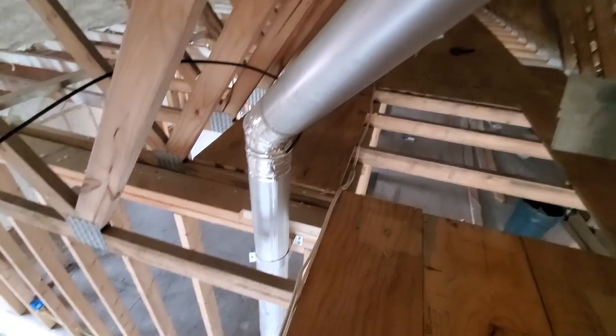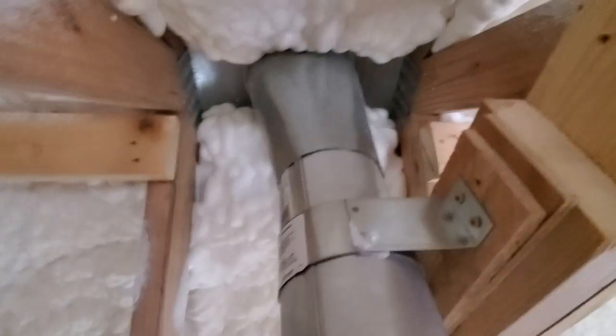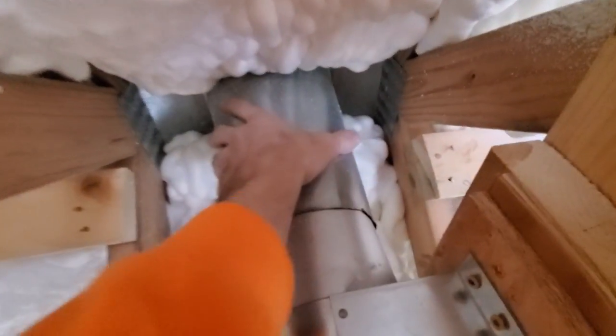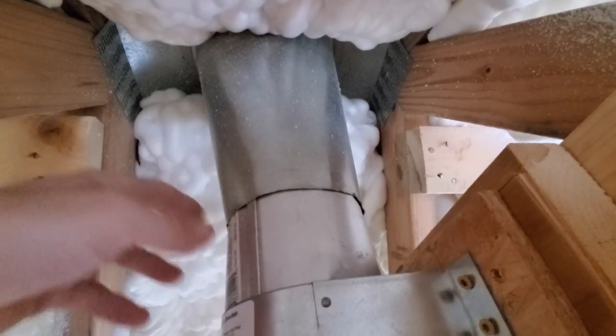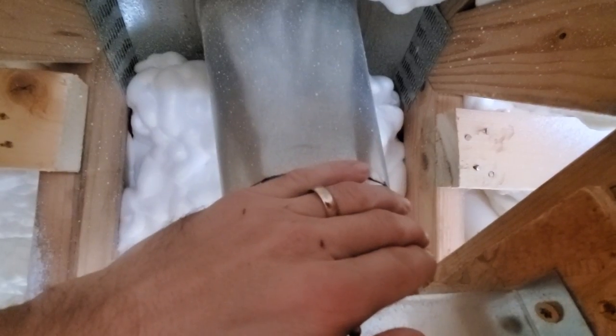This is forced air — the fan in the pellet stove is pushing air out, keeping the pipe from getting really hot because the air is pushed through. There's my insulation shield; by the time it gets up to the insulation there's a good one-inch gap. On the other side is cold outside air, so insulation-wise there's somewhat of a gap in the barrier, but down here it's warm and up there it's cold. I'm not worried about any fire hazards with this system.